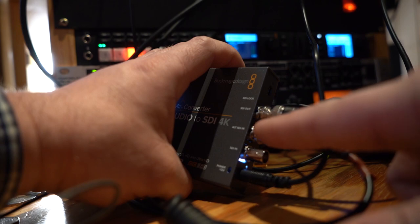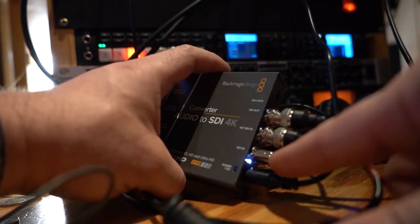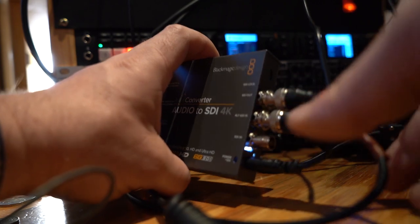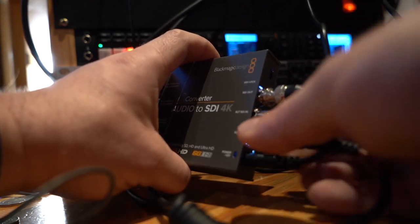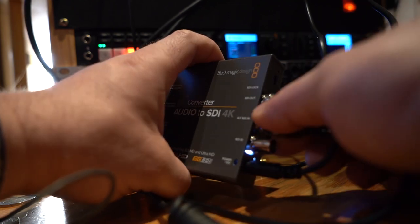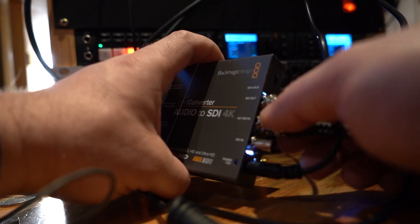Okay. There is some kind of indication. If the mini converter is not receiving data from the main SDI input, then the output is blinking. Nice. Okay, let's connect back to the main SDI input and then, ta-da, everything is okay. The switching time is about half a second, or I think around one or two frames.